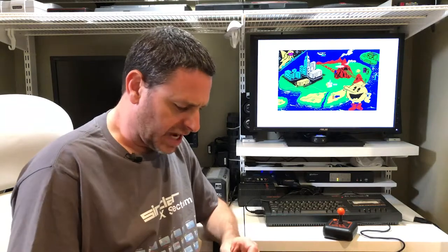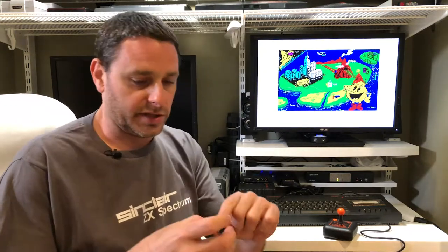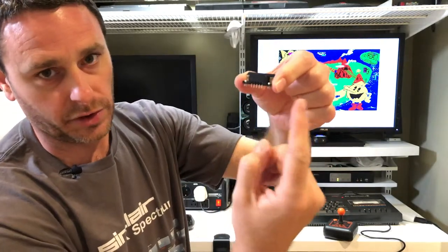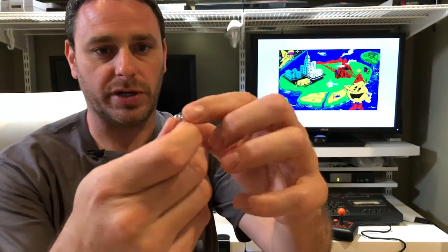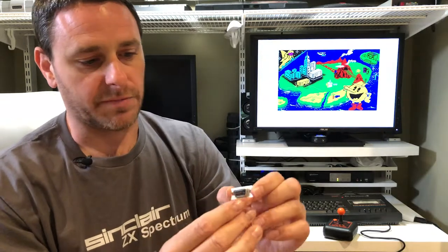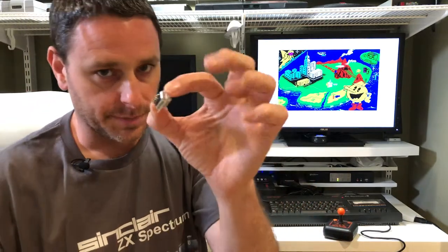One thing that I think I would change is the type of connector that I used in order to plug the Atari joystick in. I think this is the sort I used — the through-hole design — which is designed to mount onto a printed circuit board where you solder the pins onto the circuit pathway. That type of connector is great if you have a PCB design, but here I was more of a free-form type of build. So this other type would be more the connector I'd want to use, where the pins are sticking out essentially straight and not designed for a printed circuit board. I could insert the wire in, solder it down, and have a cleaner connector. I think that would have made the build a lot better in the end.